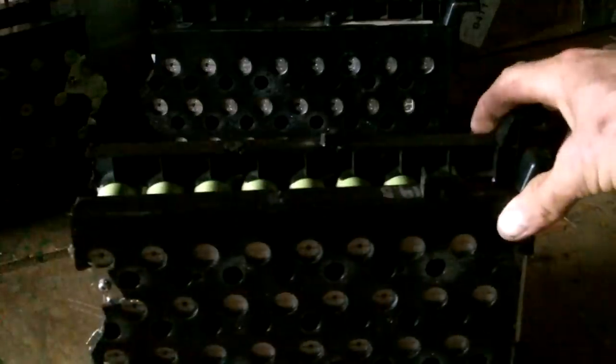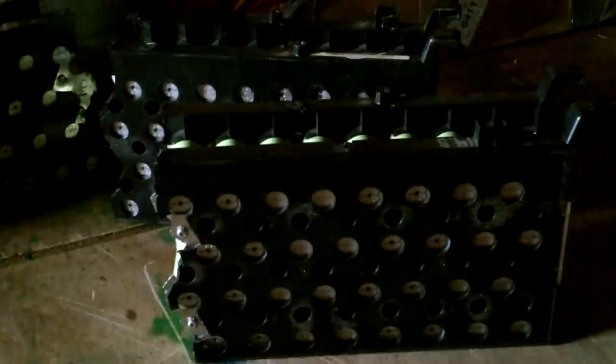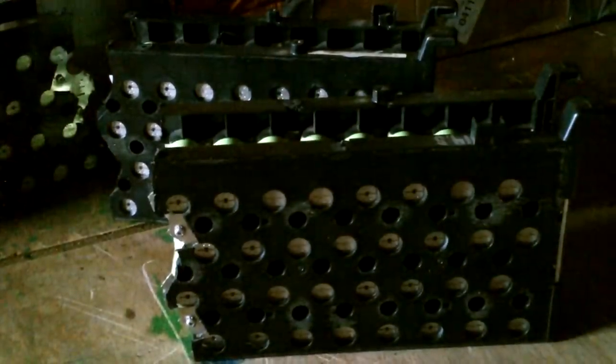Drilling these holes I need to be really careful not to hit any of the cells. I've got my drill bit super sharp with some sandpaper so these are going pretty smoothly — one here and one there. Each one of these is 12 volts and I've got some original contacts, and wherever I don't have those I have screw contacts with two wires out — in case these are pushing a lot of current. I just need to match those up with three full packs. That's a lot easier than cutting them into 24-volt sections.